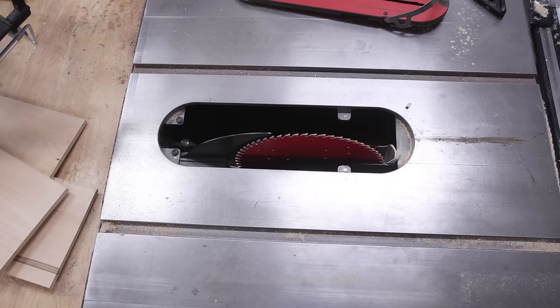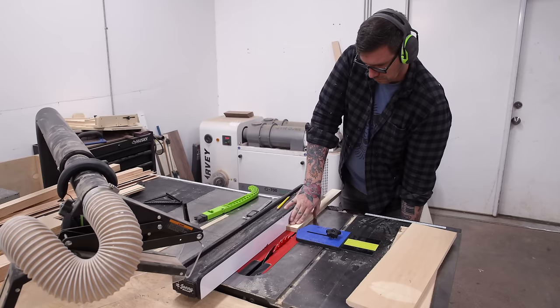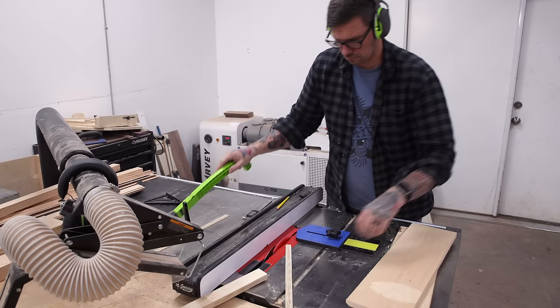Normally I use maple, which makes cutting those little angles on each strip more difficult because maple is pretty hard. This time I'm using basswood, which looks almost identical to maple but is much softer, meaning cutting those angles will be much easier. I found a few boards of basswood at my local Rockler store — these were an inch and an eighth thick, so I re-sawed them down to closer to five-eighths of an inch and ran them through the planer to clean them up.